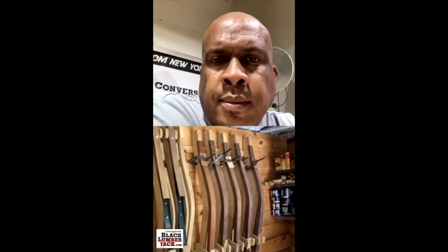How long after you steam bend them does it take for them to dry? I usually let them go two weeks in the shop and they're probably pretty good to work at two to three weeks. They go into the steamer at probably anywhere from 12 to 18 percent moisture content, then they get steamed and come out pretty wet. It'll be amazing how quick they actually dry.